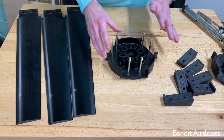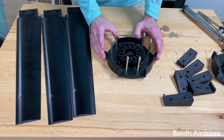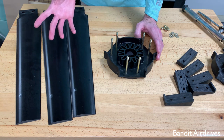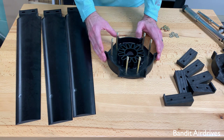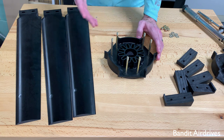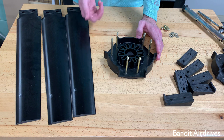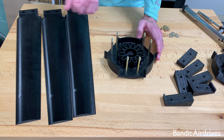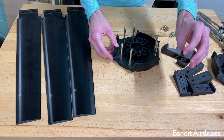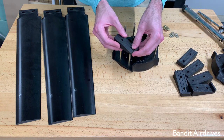So next is the most important part of the assembly. These propellers come in both left-hand and right-hand versions to accommodate engines that spin clockwise or counterclockwise. Most of the ones that we work with are left-hand propellers because most of the industrial V-twin engines like the Hondas, the Briggs, Predators, and Kohlers all turn counterclockwise when viewed from the PTO shaft side of the engine. So to do that, take your first pitch block and orient it like this.